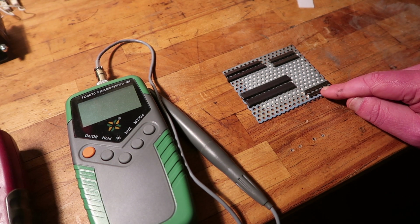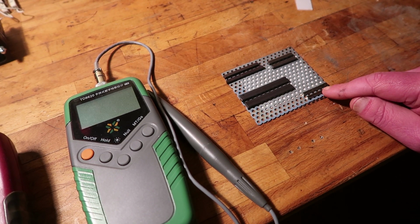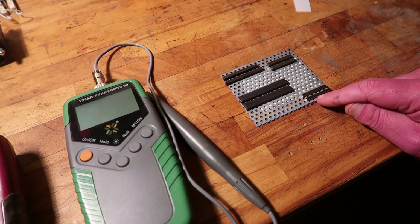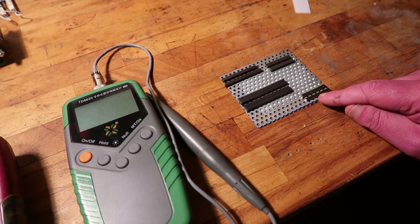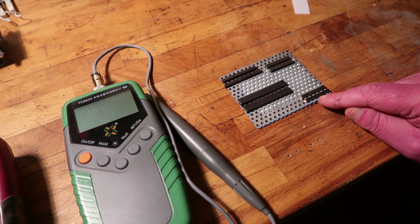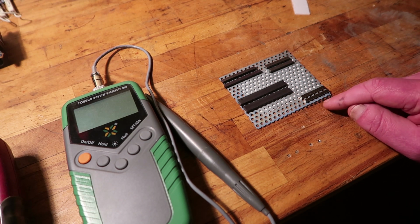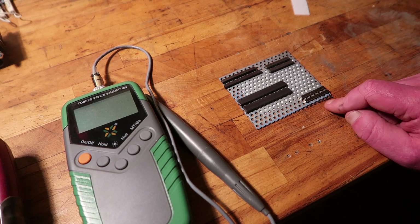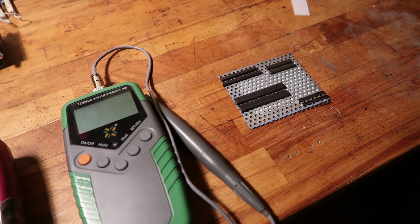So the same powders, maybe one less, I don't know, but the same powders are in this rubber magnet, filled with these powders and then extruded. These powders are also in here, but here it's like a solid. Most of it is that kind of powder, and then it's sintered, so baked to a certain temperature, and you have a bar that looks like sort of metal, which is not metal, of course, and then you magnetize it afterwards. The extruded stuff is mixed in with plastics or rubber, extruded, then when it's solidified, it's magnetized.